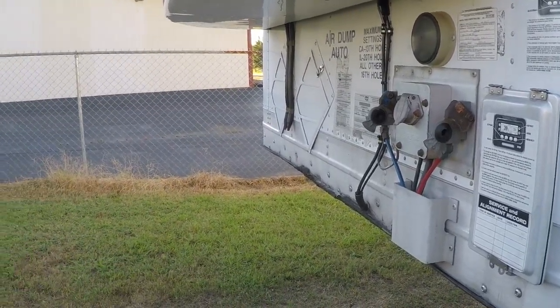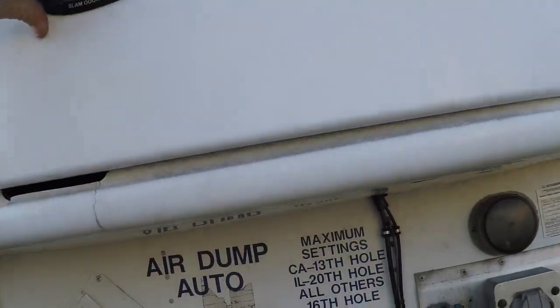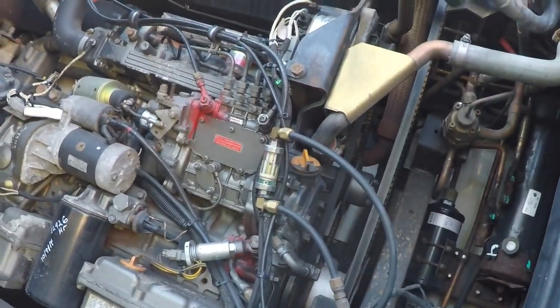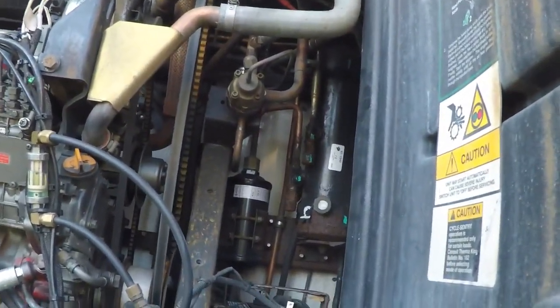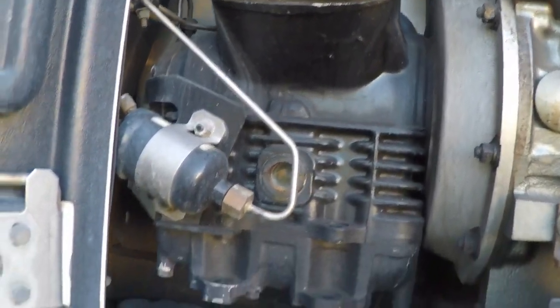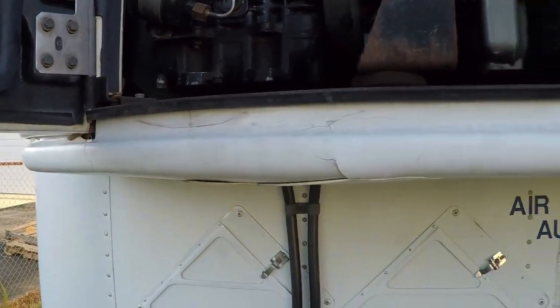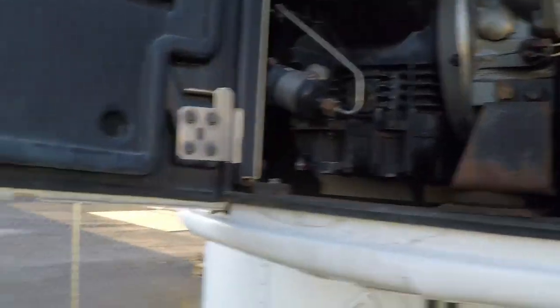This is a standard SB 210 unit — not a whisper unit. The previous owners had the compressor replaced, which was a big reason I bought it. These compressors last between 12,000 and 20,000 hours. This unit has about 13,000 hours on it, though I don't use it much. The filter reading says 14, which is about when I bought it.